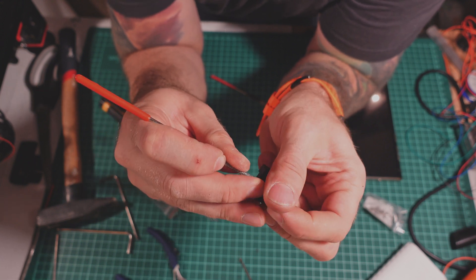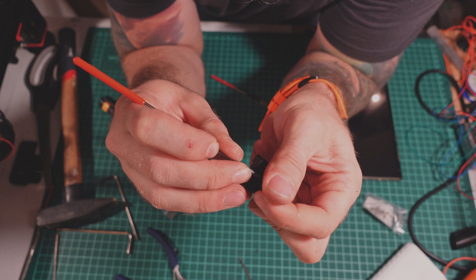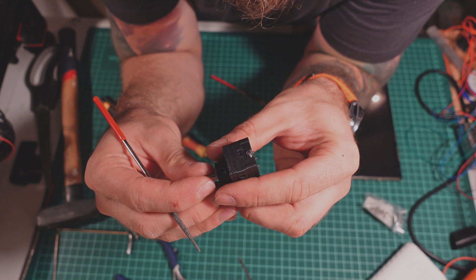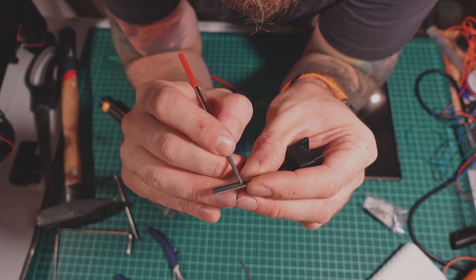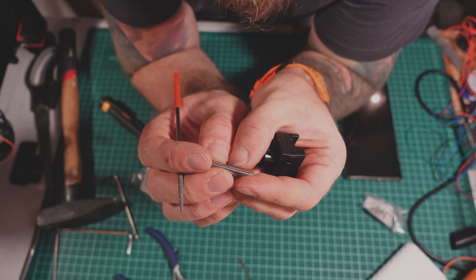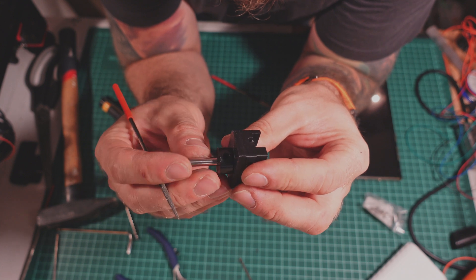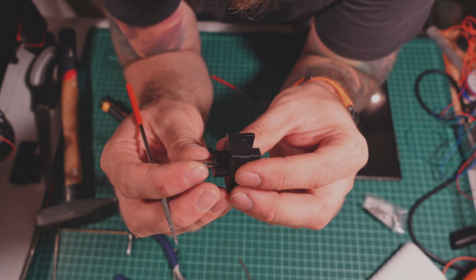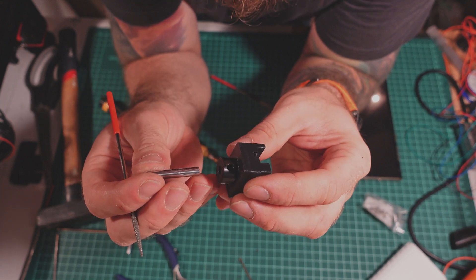Let's take my diamond file insert and turn it a couple of times. I should have a scratch on the shaft now. Here it is — so I need to dig in just enough so the grub screw can hold this without locking it in. Tricky.